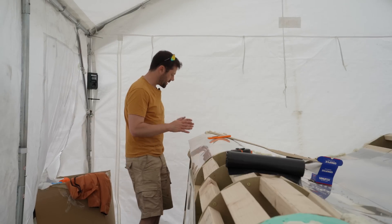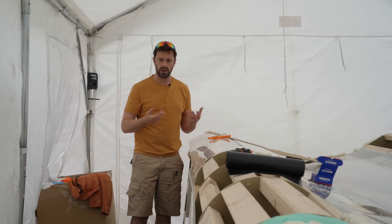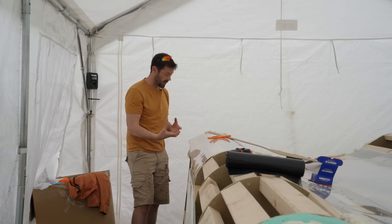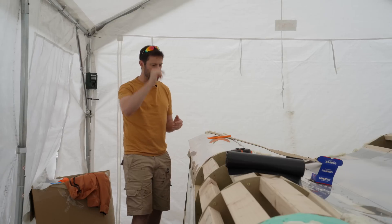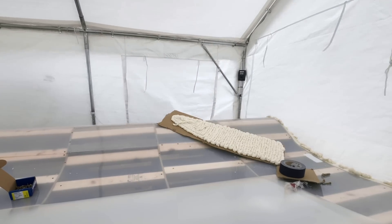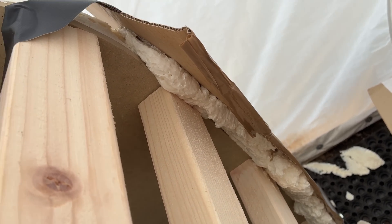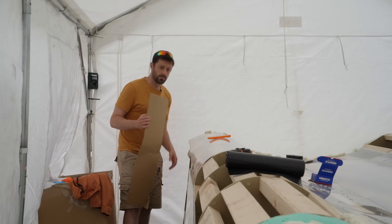I'm going to show you quickly how I've been doing the foam work on the vertical sections. Even really high quality squirty foam does tend to adhere to whatever you squirt it onto, but it's not a miracle worker. If you're doing areas which are quite large, the weight of it as it starts to expand can sometimes droop and fall off onto the ground. So I use a piece of scrap cardboard and basically paint the cardboard with foam, let it puff up for a couple of minutes while it's still very sticky and adhesive. Then I plunk it onto the vertical bit, let it cure, rip the cardboard off, and then fill any voids or gaps. Normally in one, two, maybe three iterations, you go from a completely empty void to an area of foam that can then be shaped and finished.